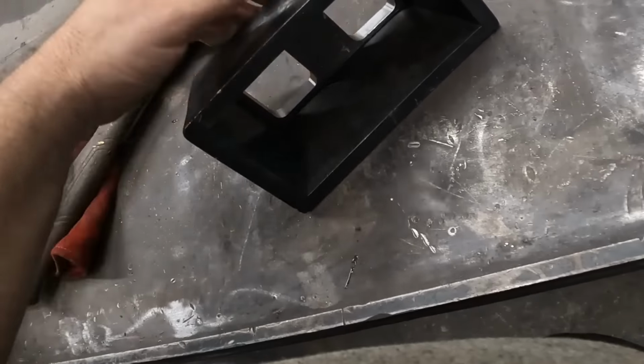We'll see. Or maybe I might need to do something that's softer than the copper, which is probably aluminum, I don't know. You think aluminum is softer than copper? I think so. Maybe I'll make them out of aluminum and see how it goes. We're going to be fly cutting it, so it's not like it's going to be a lot of pressure, but we just don't want the stuff moving and we want to be able to get a pretty precision cut.